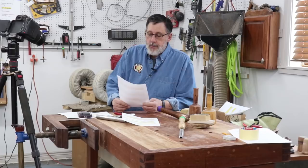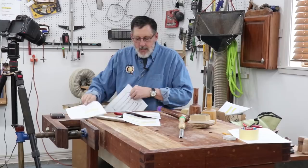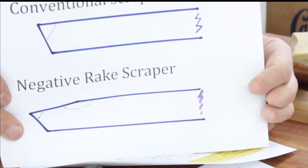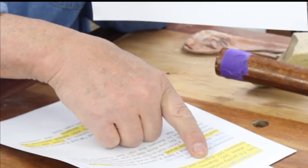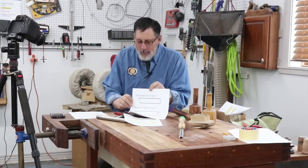John Repplinger has good eyes. In one of my videos — possibly on the negative rake scraper — he looked at my angle and understood that it was not 135 degrees. He said: 'I'm pretty certain that the angle on top of your negative rake scraper is 165 degrees, not 135 degrees.' John, you were absolutely right. I measured it again and it was dead on to 165 degrees.